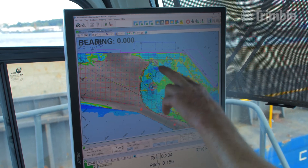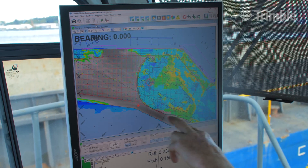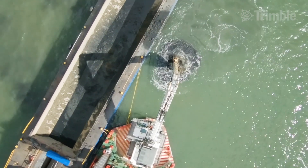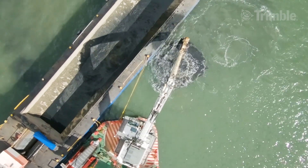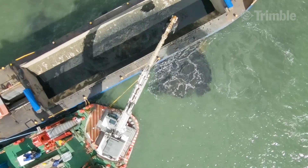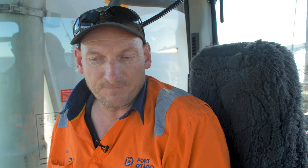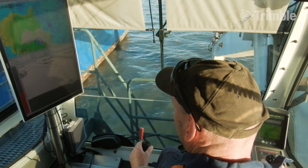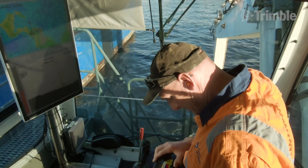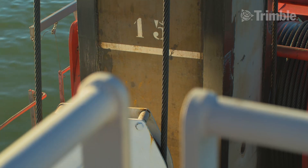This tool is like having a camera underwater. I'm able to get within 100 to 200 millimetres on the sea floor of our target depth. We can dig in one area and then move across half a bucket and pick up the spillage and cut at the same time. The Trimble System itself calibrates for the tide and what our target depth is. It also has pitch and roll, which enables us to set the barge up accurately at any one time.